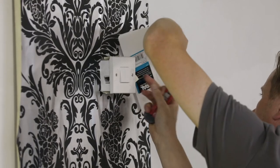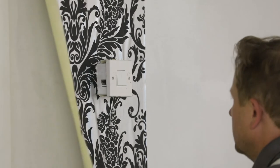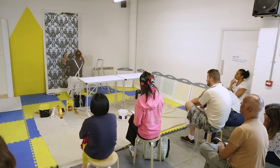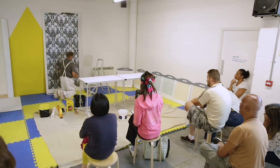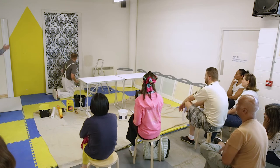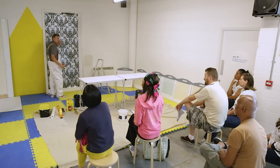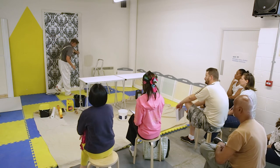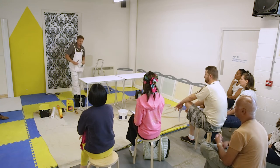Move it out like that and trim it exactly the same as shown. That's two lengths hung and then the rest just carry on — it's as simple as that. Make sure you wash down the edges and the tops and bottoms; you don't want paste left on your paper. And that's basically about it — any questions, come and see me afterwards.